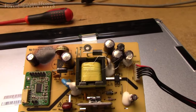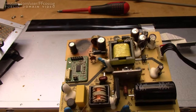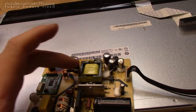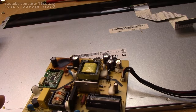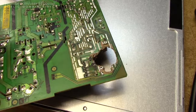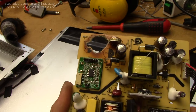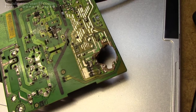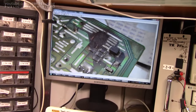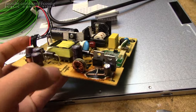Perhaps there's a bit of an extra boot circuit here. I'm basically just going to desolder all of the burnt stuff, clean the board up a bit, and see if I can power just this — basically the entire board — off a DC power supply. Quick mid-point check-in: I've ground off all the bad carbonized materials, we've now got a big hole in the board, and now I'm going to reconstruct the circuit from the pictures I took before I ground everything off. Here is the finished repair — I just have to replace the caps still.